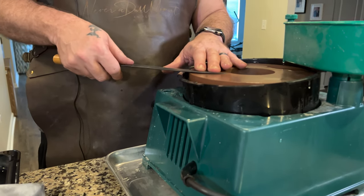For some of you who polish, you're going to think this is a whole lot like polishing. The difference is when you're polishing your goal is to get the scratch marks very even and get to that high mirror finish. It's kind of the same in thinning — first we need the knife to be thinner before we worry about the scratch marks, then we want it even so it reflects light evenly. I can tell you that if you do just the 1000-grit by itself with scratch marks in the correct direction, it looks pretty shiny.